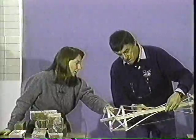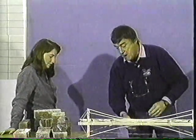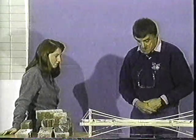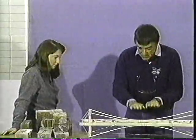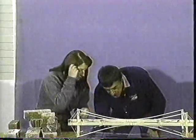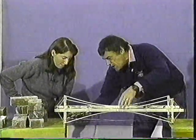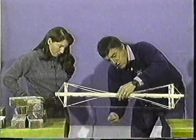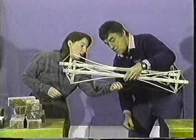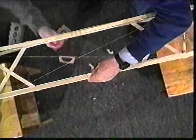This upward parabola probably wasn't necessary. I think you're absolutely right, because all it's going to do is bend even more, so there's a little bit of weight you could have saved there. You're putting the bricks on top, aren't you? So you've got this arch shape here whose feet would start to want to pull out. It's restrained because there's a tie from there across to its diagonally opposite one. No, it's tied here — it's pre-stressed along here and then tied together.